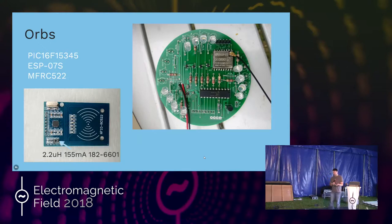The boards, when they're asleep, draw about 2.5 milliamps in total across the whole thing. When they're awake they draw about 5 milliamps including the PIC. The RFID reader draws about just under 30 milliamps when active, and the Wi-Fi module is about 70. So you can see, adding all together, I couldn't afford to have the Wi-Fi module on very much.